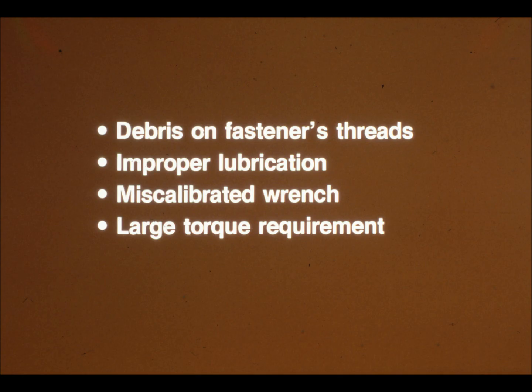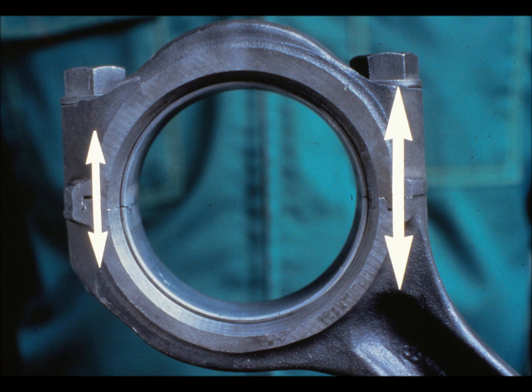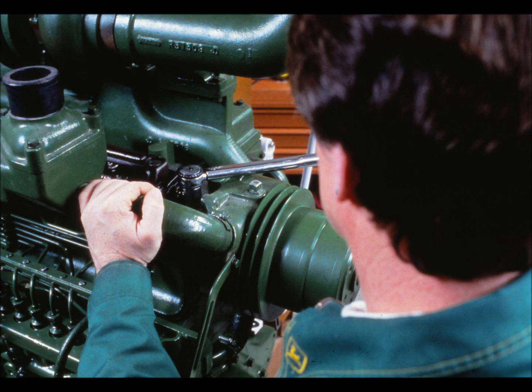In some cases, these inaccuracies are not critical and you can use a torque wrench to tension a fastener. But in other cases, you must use a more accurate method. For example, the cap screws on connecting rod caps in some large engines need to be tightened very accurately. The cap screws must be tightened accurately so that they can be tightened equally. If one cap screw has more tension than the other, it will tend to carry more of the load. If the extra load is more than it was designed to bear, the cap screw could fail, taking the entire engine down with it. Cap screws with equal tension bear the load equally. Also, modern engineering design makes fastener tension an important part of any system that has to take a lot of stress. You need to tighten the fasteners properly to get optimum performance from the machine.